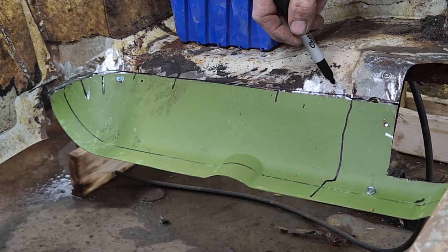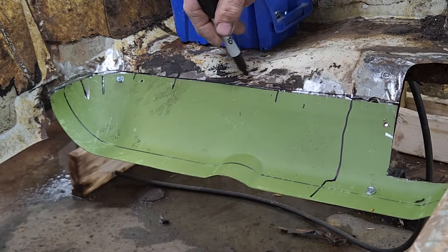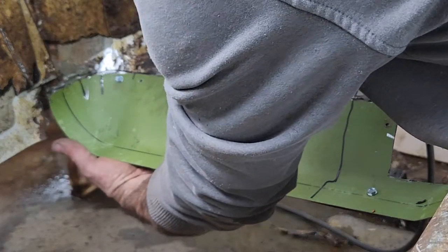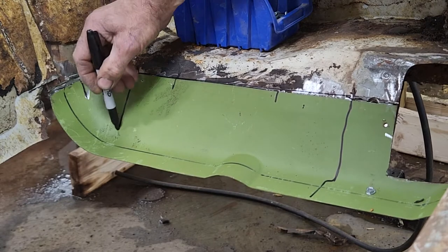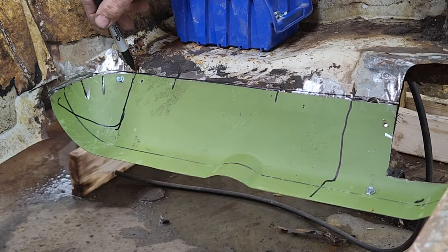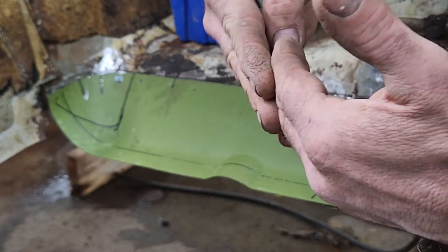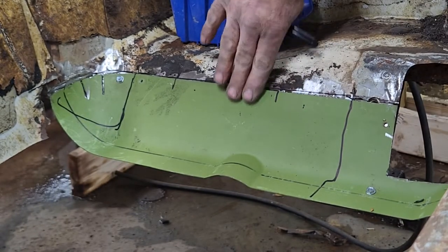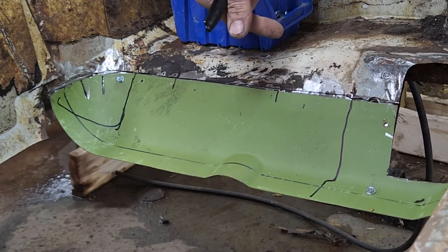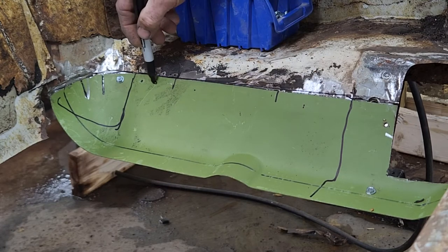I'm gonna use my crimping tool that I showed you, the hole puncher. The other side's a crimping tool. And I'm gonna crimp this metal from here to here, where there's another brace that goes right here that goes kind of like this underneath. So I'm gonna weld solid to that, and I'm gonna flange it from here so this piece will fit right on top of the other piece, and it'll be smooth in here. There'll be a little bit of a notch on the back side, but right here it'll be smooth, and then I can just seam seal both sides, and then weld it solid or just do uni spots.